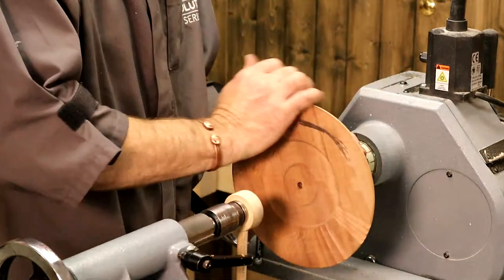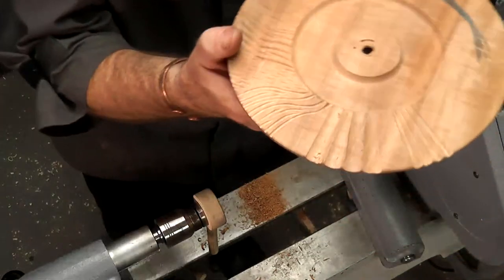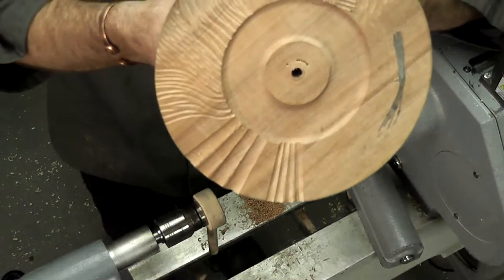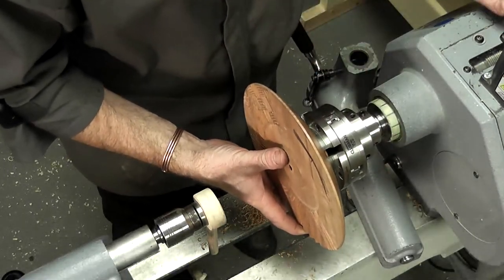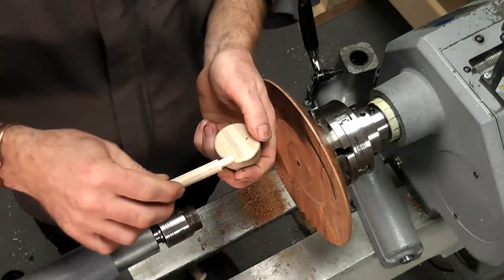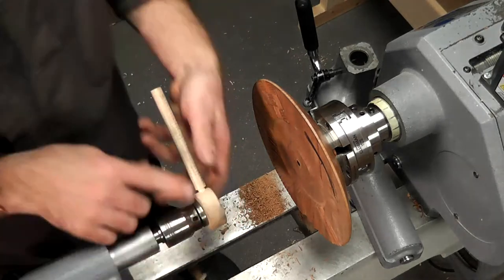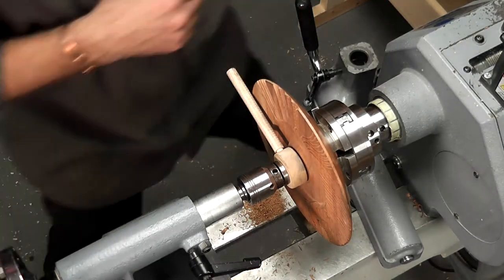I can move it down again - my little arm is giving me the accuracy of keeping it straight, giving me a location to start. The little screw that comes through digs into the top of the bowl just to stop it slipping. Another little V - do one more of those. Sighting from the side I can see where I'm going to start. Lock that into place by bringing the tailstock up. Got a little bit of movement there - let's do that back up. Not quite as deep - I'm just going to extend them. I've got enough as a groove now just to run that through. Nice hollows coming up in here - these are V shape, they work quite nicely. Radius from the centre - if you changed how the pin is supported, drilled your holes so you're higher up and off-centre, you could actually get them coming higher up off-centre on the bowl - you'd get like a spiral staircase coming round. Great way of just supporting that and getting a location.